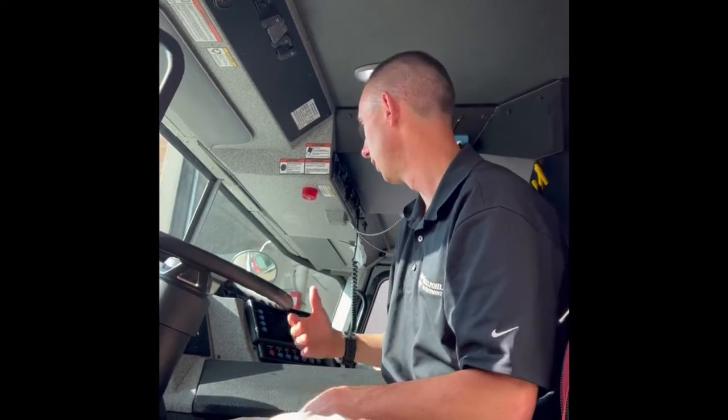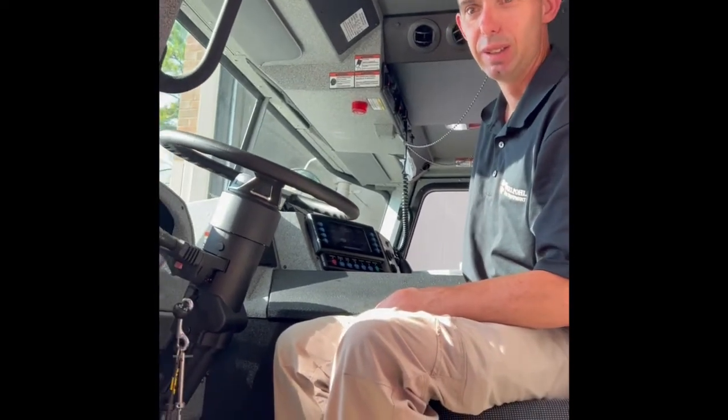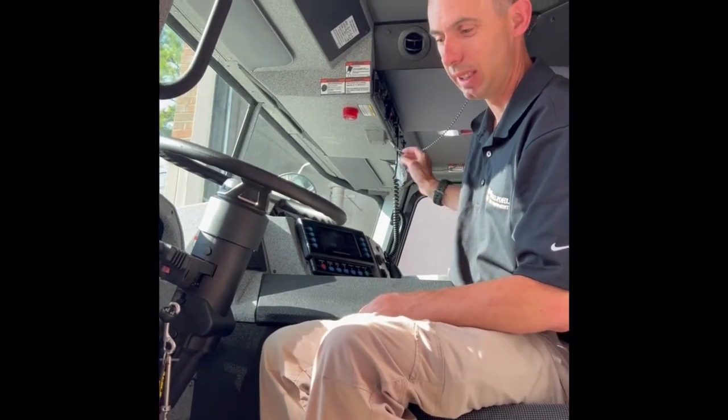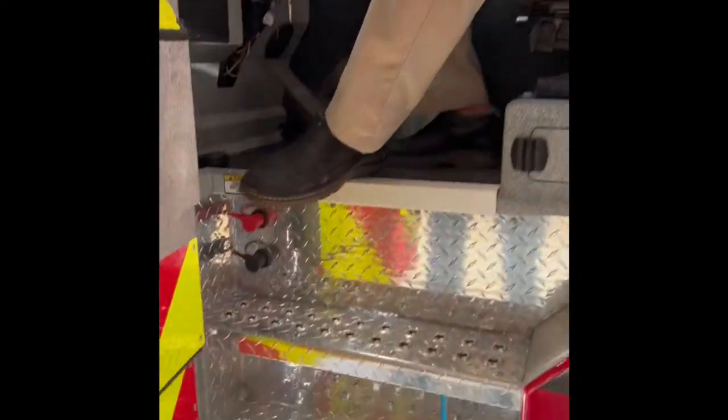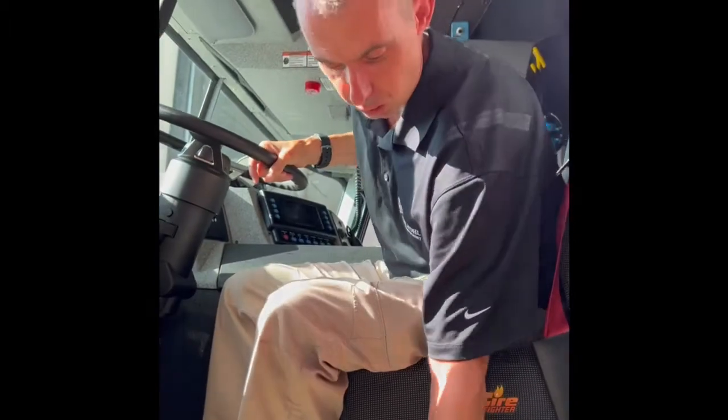This truck has the condenser on the radiator, and I think your other one's the same way. You'll notice the engine fan gets louder when the air conditioner's on - all that's doing is pulling extra air through your condenser so the air conditioner works better. If you ever need to make the truck quieter and you don't need the air conditioner, just turn that AC switch off. You can check all your fluids through the engine cover - you can look at your sight glass for the radiator, your transmission dipstick, oil dipstick, and power steering. Your washer fluid has a window in the bottom of the step where you can see the level, and you can fill it through here, or if you tilt the cab there's another fill right in that area too.